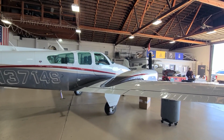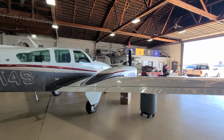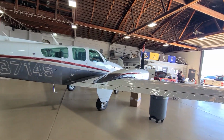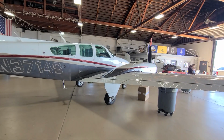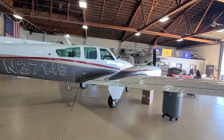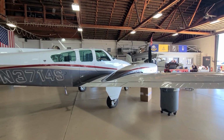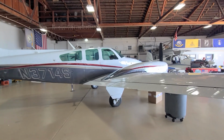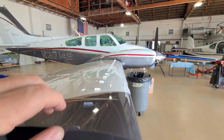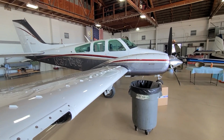Plus those Iskras, I believe, have some sort of gear set in them, so there's supposed to be a little cushion there, but there's not. I don't know. So what we decided to do was we ordered 2 overhauled, used to be TCM Energizers, the wound ones, not the permanent magnet ones. Because everybody we've talked to has now said that, hey, those lightweight starters, they just can't do it, especially if you have an EIS system. You need the engine to be turning up fast.